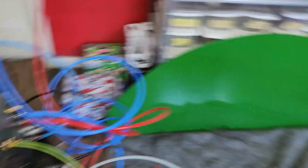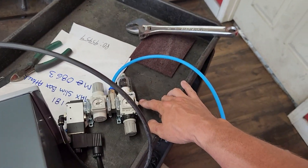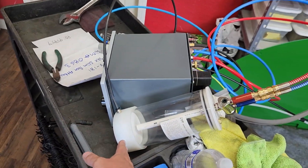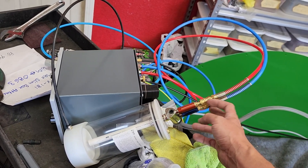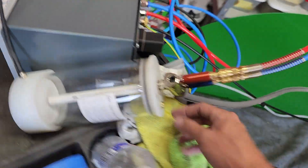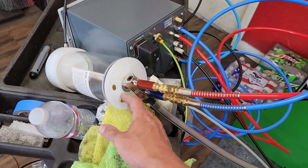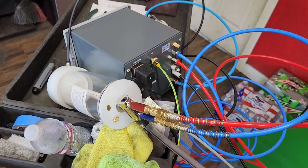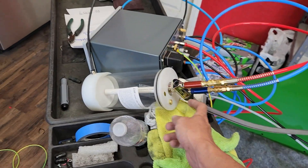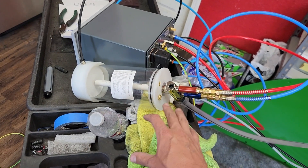The gun's hanging up there and we've got everything tied together. Now it comes into the hopper right here — once I get the gun off the tension should be fine. All I have to do is switch out my air inlet so I can hook up to shop air and then we'll fire this thing up. We'll see without powder what our fluidizer air feels like and how much air we're getting through the top lines, because I think that's where they're having problems blowing this thing apart. There is a relief filter here that should be letting the powder pressure out — if not, we may have to take it out or find a different way to evacuate that pressure.